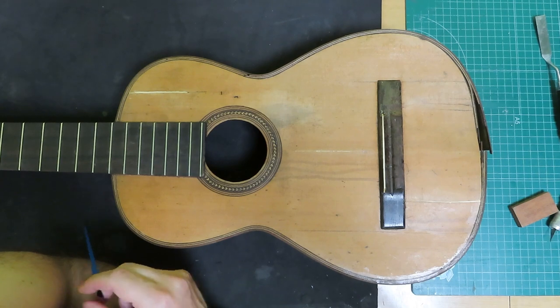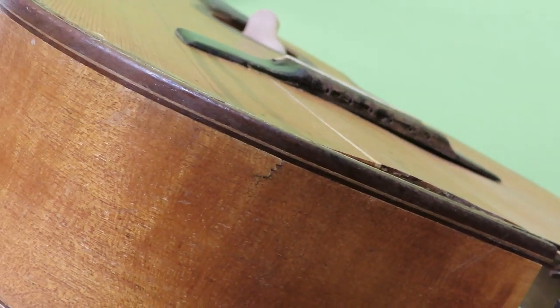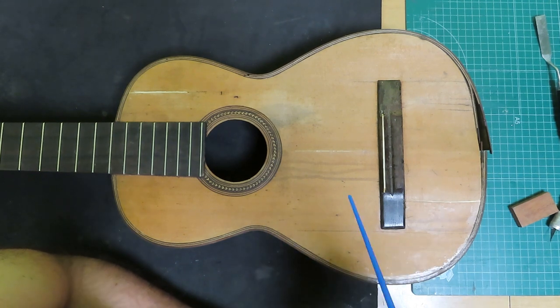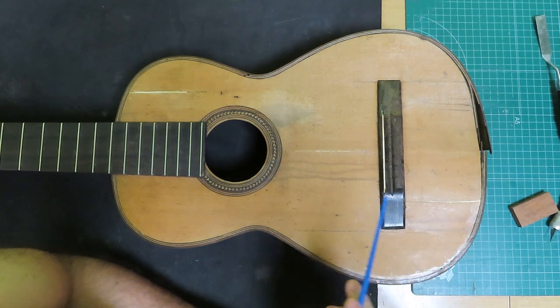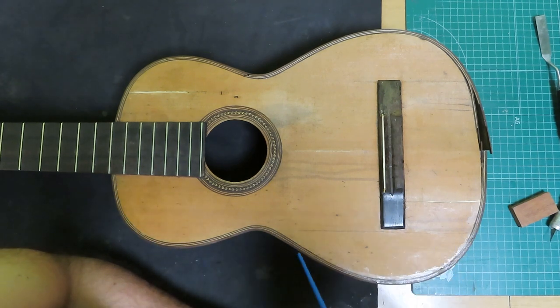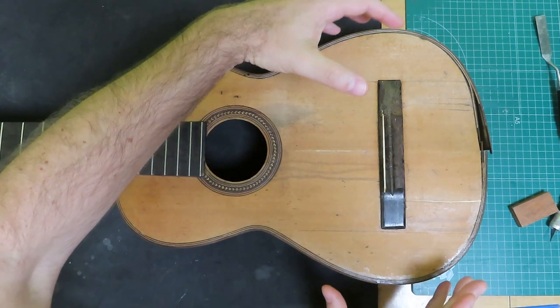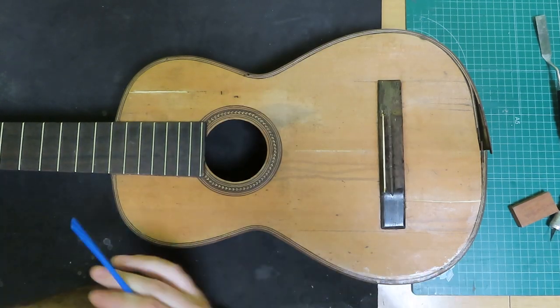That's weird. I mean, in these cases, the top of the guitar has dried. You place the insert and this should not be happening, but all the guitar was peeled off. So now I think that probably it is the insert that causes the problem, and maybe this is not needed anymore because the guitar was peeled off and then all the bindings re-glued. Even if I don't actively look to reshape everything, all the top of the guitar has shrunk, is smaller, and maybe now the binding is taking that shape.